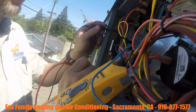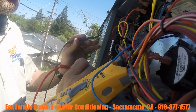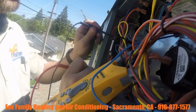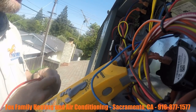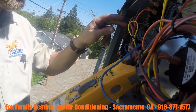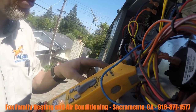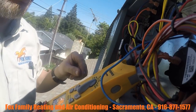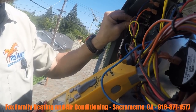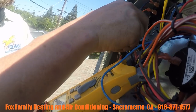Let's check the load side of the contactor. We're going to check the black wire running to the contactor — the common wire — and the red wire going to the compressor, which is the run wire. On the load side of the contactor, both lugs are touching ground. That's usually indicative of something major going on with one of the motors. We've got line wires connected, fan motors connected, and the compressor connected. Based off experience, I'm going to take the wires off the contactor from the compressor and stash them so they're not touching the frame.